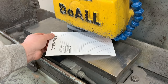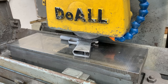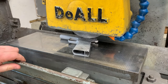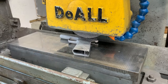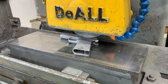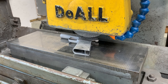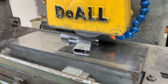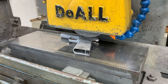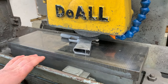I might have to drop the camera down a little bit so you can see the wheel. Okay, so now you're at a better angle so you can see the grinding wheel. There's still a tiny little gap between the wheel and the part so I can spin the wheel, but when I put a piece of paper through, just the thickness of that paper is enough to catch and turn the wheel. So I know I'm about 3 thousandths away from my part right now — that's plenty good for a starting point. I'm going to start the spindle up, start the automatic back and forth feed, and we're going to touch off or spark out on the part. I'll adjust the head down until I see the grinding wheel start to grind the part, and then that's a good starting point.